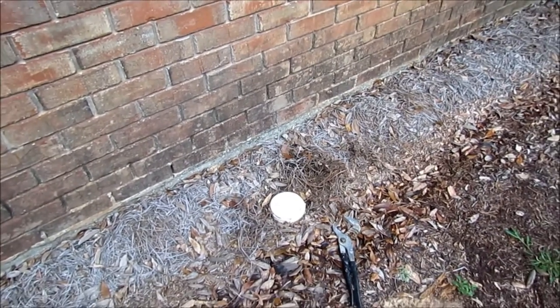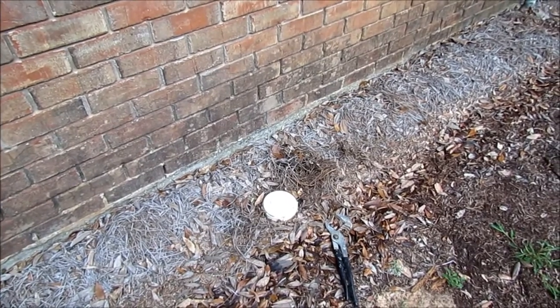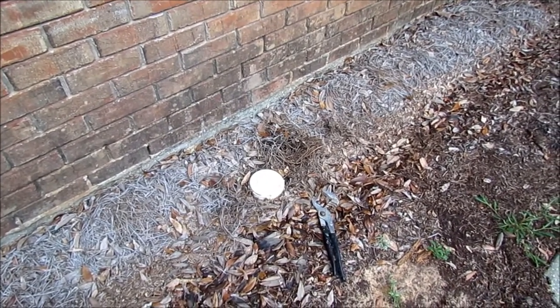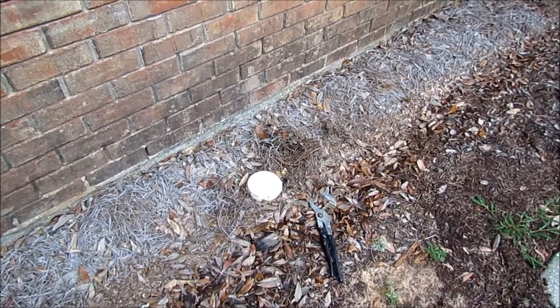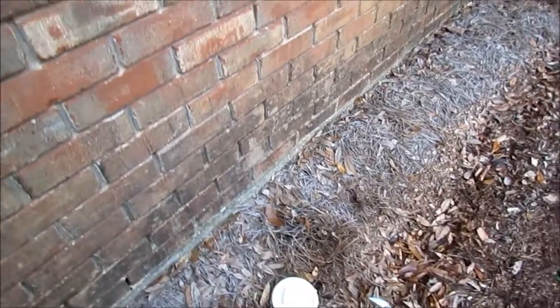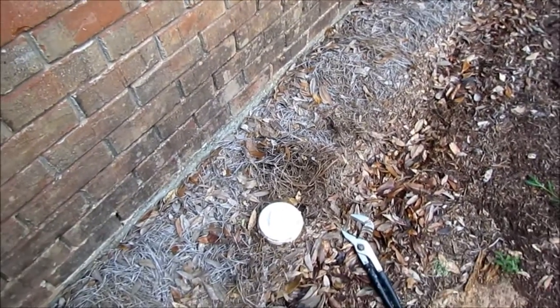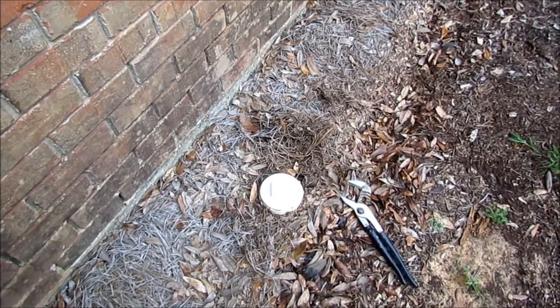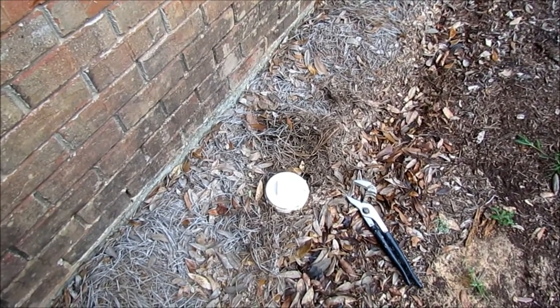Hello, I'm Chuck Phillip with South Alabama Home Inspections and welcome to another edition of Southern Home Talk. What we're looking at here is a 4-inch clean out which is located at the back of this house, and hopefully you have one located somewhere around yours. It could be buried too, so that's why it's important not to let a lot of debris cover this up, because there's going to come a time where you're going to need to come out here and possibly unclog your drain.